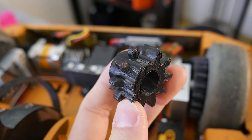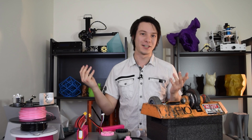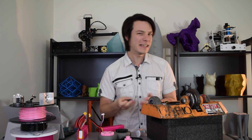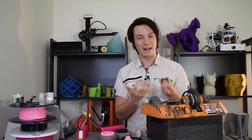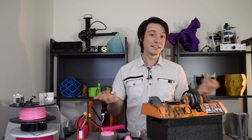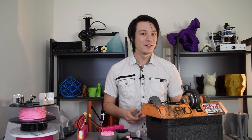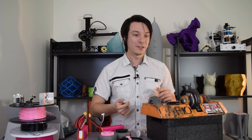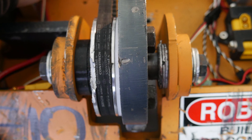How about the 3D printed gears? To my dismay, one of the pinions had lost a couple of teeth. Looking closer at the failed print, it looks like there was a layer with some under-extrusion, and that's where it sheared — it cascaded and broke a few teeth behind it. With nothing to lose, I ripped the old pinion off and put a spare on. I printed a lot of spares for this robot and got ready for the next fight. All the other parts seemed intact, including the weapon spacer — which is under tension holding the pulley to the weapon — and I expected that to just explode instantly, but it didn't, which is really cool.